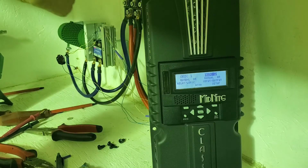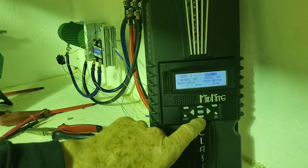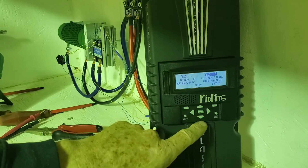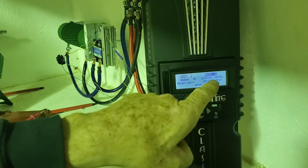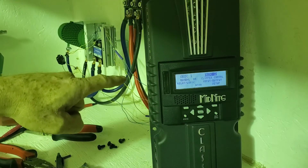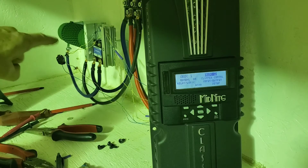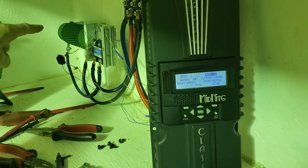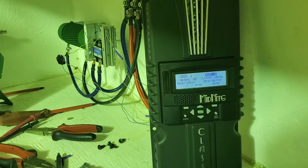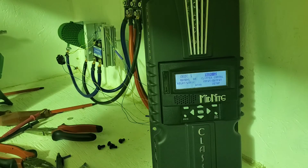That sends the battery power to this relay here, which will divert the wind turbine to the dump load instead of overvolting the thing and letting the turbine spin freely — just like the clipper does. And when Aux 2 is on in clipper control and the battery's getting full, that extra power from the turbine will be diverted to the resistor, and if it overvolts the Classic, the power goes to the resistor. Same way the clipper works — exactly the same.